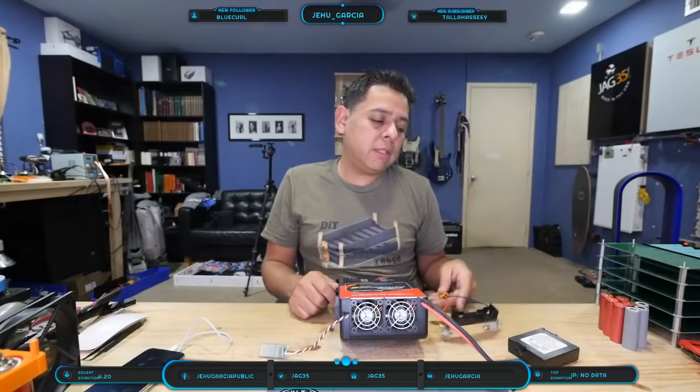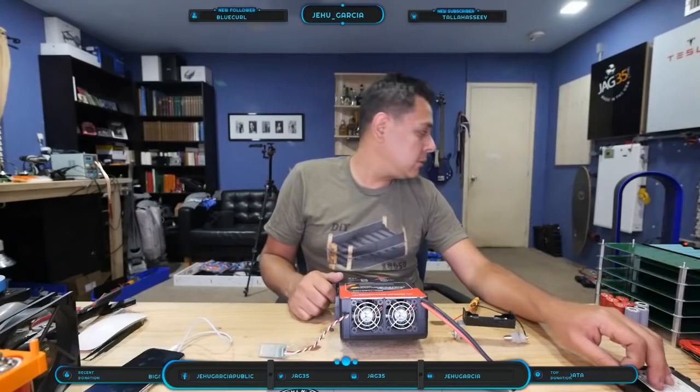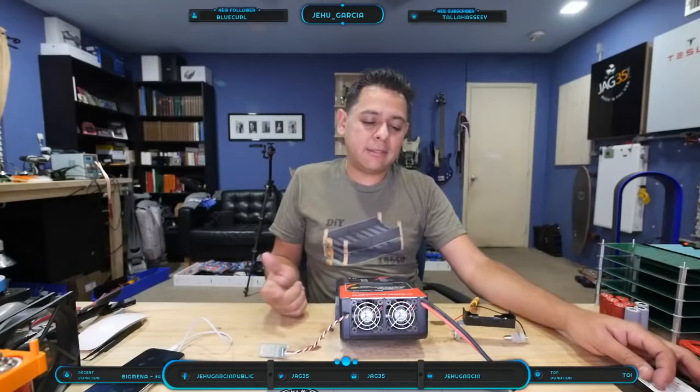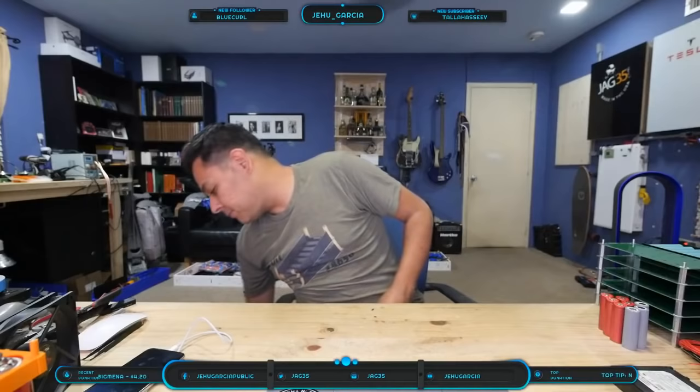What that will allow me to do is process, charge and test battery packs up to 12S. There are a few of them here, so it will work for those, but it won't work for those LG Chem cells that we can buy, because those are 16S. It won't do those on that new charger. You'd have to have two of these PowerLab 8s. Anyways, yeah, the fancier chargers have a setting for storage. Sorry, that was a long answer.